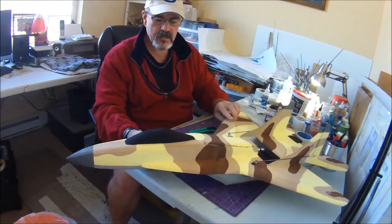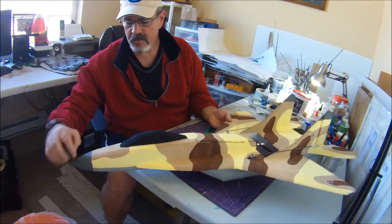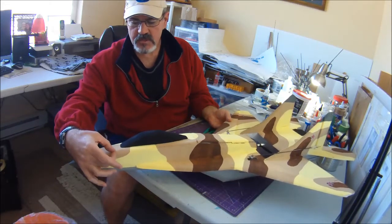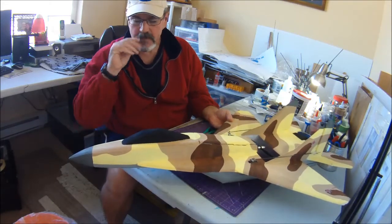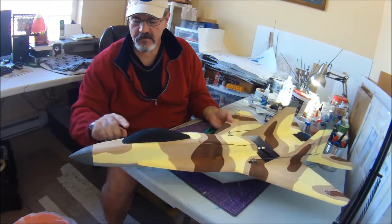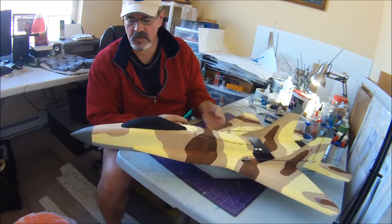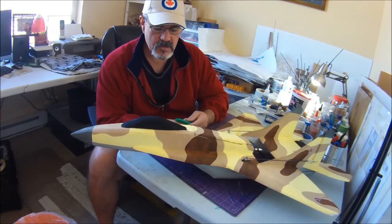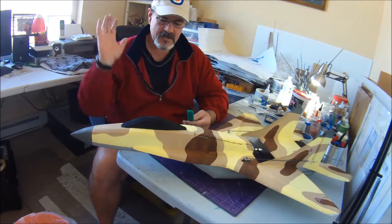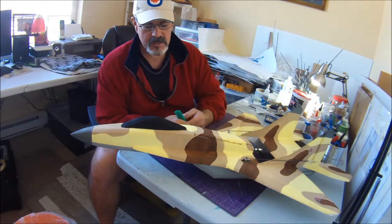Stefan actually likes to fill, imagine here when you've built this, now you've got sort of two square edges where the two pieces meet together. Stefan actually likes to fill with scrap foam and foam cure and then sand that down. So what I've done is I've gone back to an old technique that I used to use, and use lightweight filler. But what I used to do before was I didn't shave it down first, I just glopped on all the spackle and then sanded it, and that just added a ton of weight to my plane.